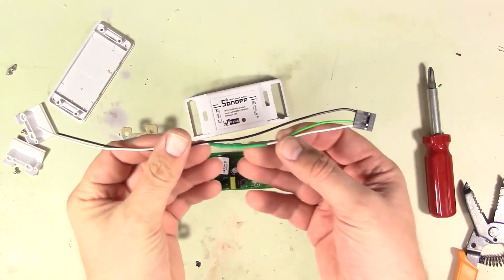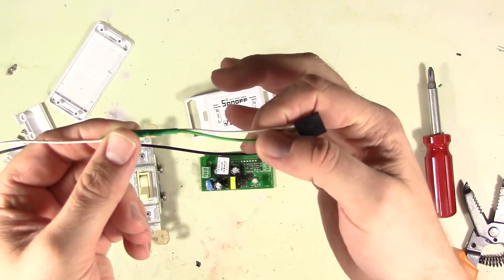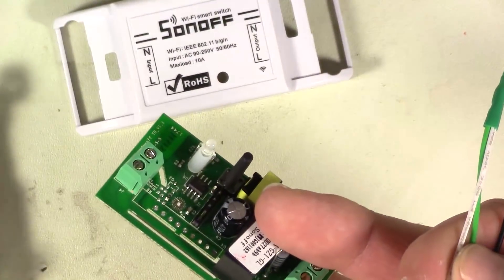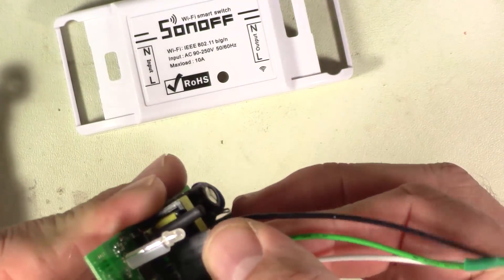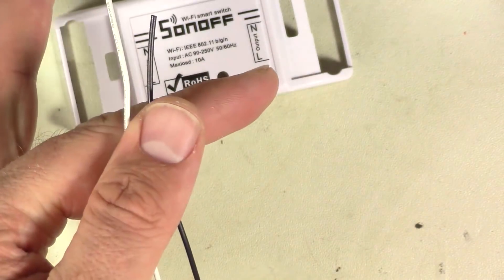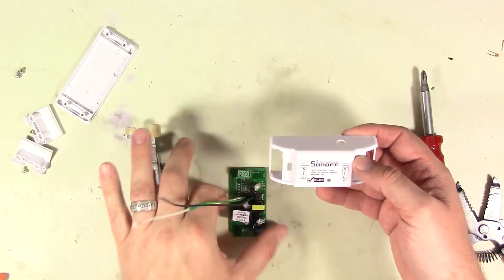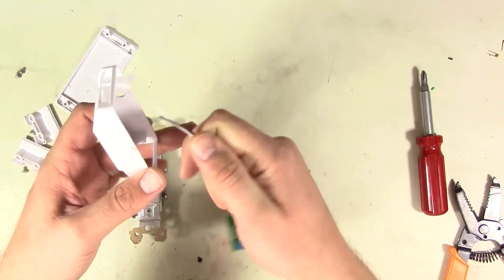Now I'm going to install the resistor between these two pins - the ground and the GPIO wire. I've put a little bit of heat shrink tubing on it. You can see the little resistor in there; all I did was tie the green wire and the white wire together with the resistor. Now closest to the little reset switch is the three volts, so I plug in the connector just like that. These are the two wires we'll hook to our switch. I've drilled a little hole in the case so I can thread the wires through.